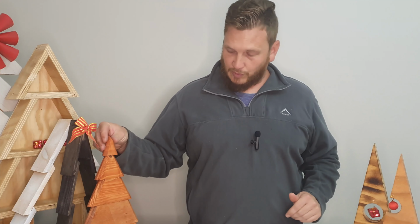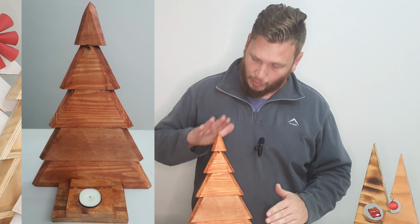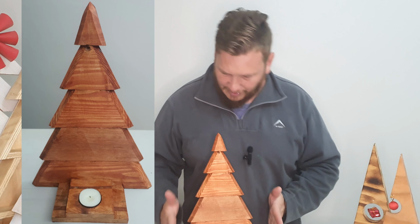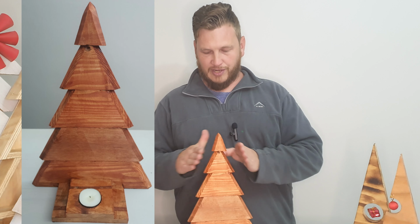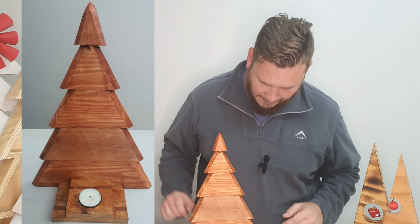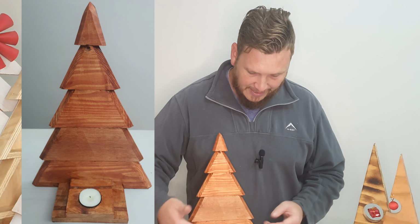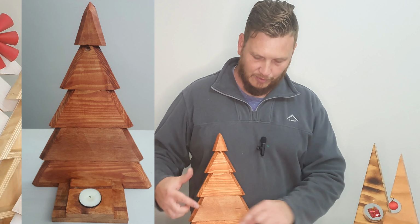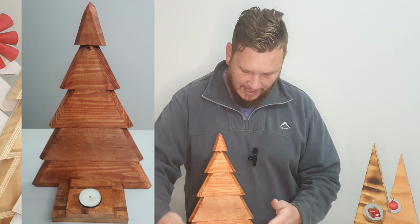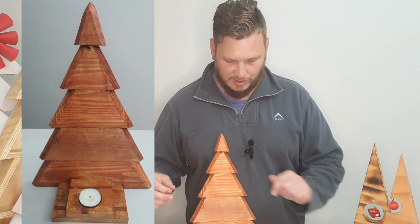Third one, again a very simple design, very easy to make. This is all made of reclaimed pallet wood. I took the pallet wood in strips, cut them to various lengths, and then cut 30-degree angles on the edges of all of them, making them smaller as I go upwards up to the sharp point on top. At the bottom, two flat pieces of pallet wood, the one shorter than the other, with a sunken hole cut in the top one for a tea candle. This was stuck against the upright with two screws and some wood glue, similar to the smaller one that I made.